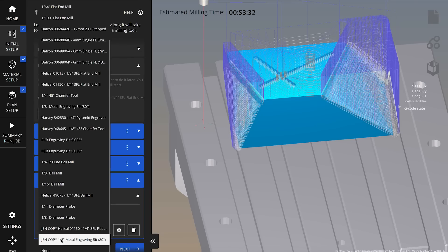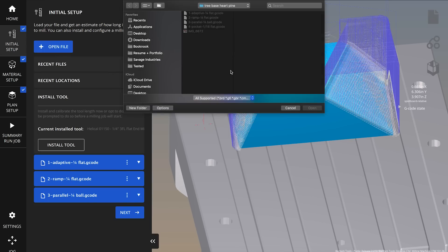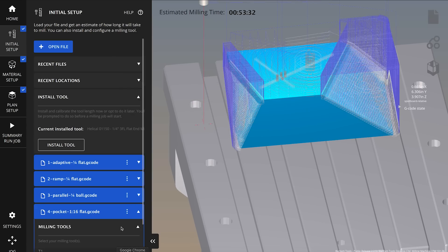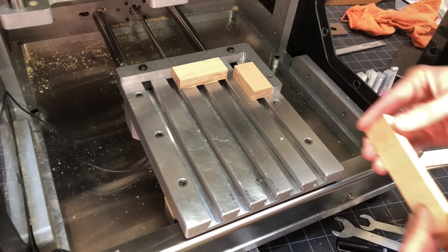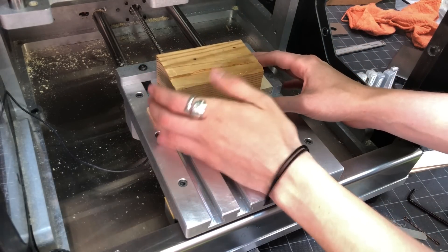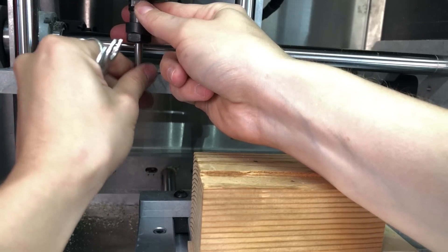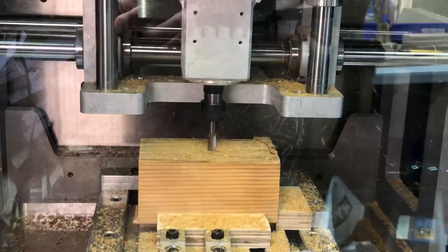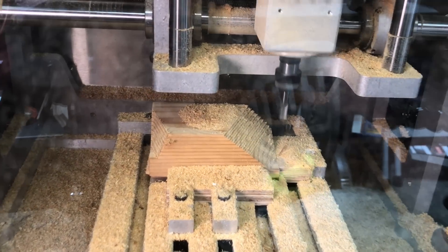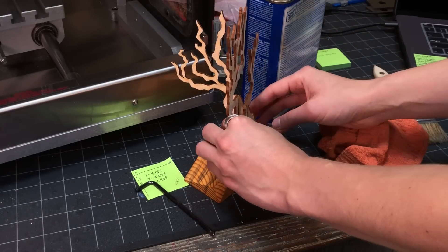After the first few projects went smoothly, I decided to dive into some fully three-dimensional designs. I started with wood because I figured that would be the softest and most forgiving. I created a base design to hold a small laser-cut plywood piece and got some help with the CAM setup. Fixturing was a bit tricky because of the angled faces dipping so low to the bottom, but I got creative with some plywood spacers. In this case I had to use manual probing to locate the stock since wood isn't conductive — you just jog the spindle in increments until you touch the face of each side and then zero it out. I ran a test cut in soft pine, then a finished piece in heart pine, which turned out fantastic. The tolerance for the laser-cut parts was spot on, and after a finishing parallel pass with a ball end mill, this needed barely any cleanup — just some 220 sandpaper and a bit of oil, and it looks like a finished part.